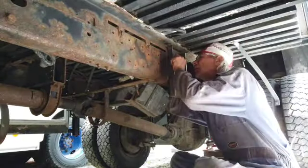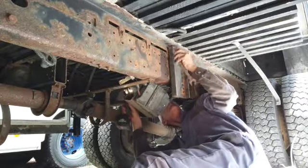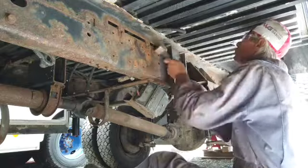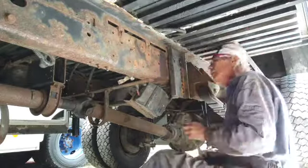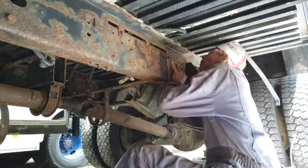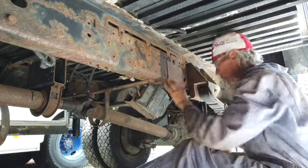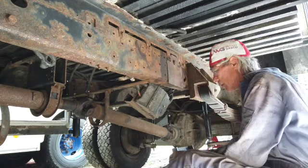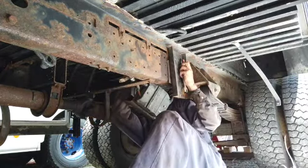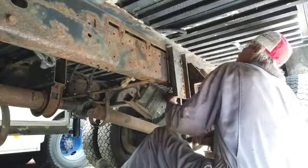You'll see I put a hole in the channel. One of the bolts for the ABS brain goes through there. Now, these jacking kits, the intention is to weld them to the frame. And there's a whole bunch of reasons why I don't like that idea. Here's one of them: I can't get that bolt in and out once that channel is flipped around. Instead of having the channel the way I have them, with the flanges pointing away from the frame, the flanges get welded to the frame, and then you bolt directly to the channel and don't bolt to the frame at all. You just weld that flange on the frame and then bolt everything to the channel. I wouldn't be able to get this bolt in and out for the ABS brain if that channel was welded on.